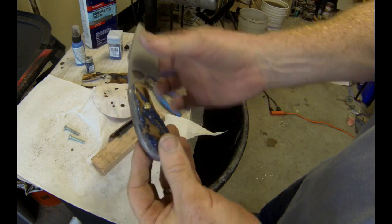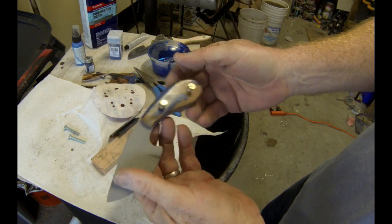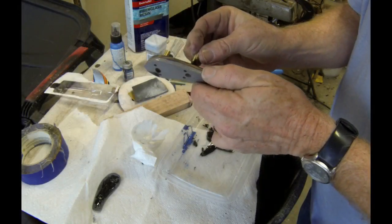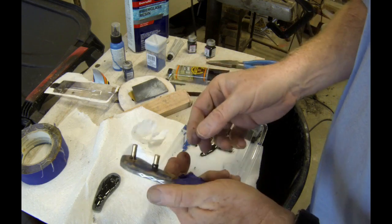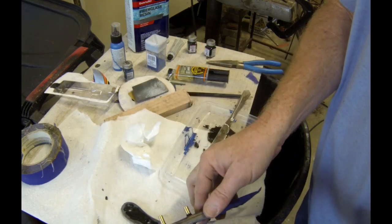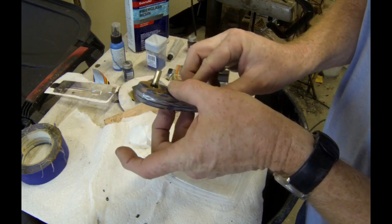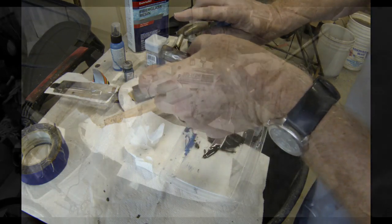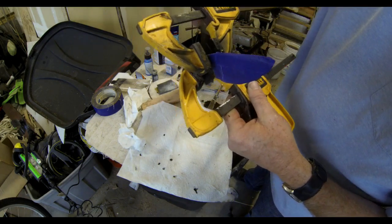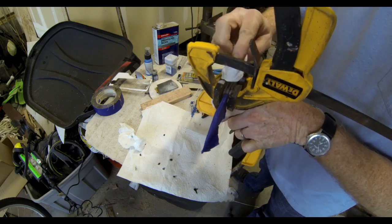The final fit will be with a two-part epoxy. These scales fit pretty nicely, so I'm going to tape up the blade so I don't get any epoxy on it. I'll put just a little bit of epoxy in the middle and keep my fingers crossed that I don't get too much on the blade or the spine, because I really don't know how I'd get it off that glass bead finish. So this is just pinning and gluing the scales onto the blade. I mixed a little bit of black paint in with the epoxy, clamped the scales in place, and I'll leave them for a good 24 hours before unclamping. Then all I have to do is cut down the excess brass pins and do a little final sanding on just the face of each side of the scales.